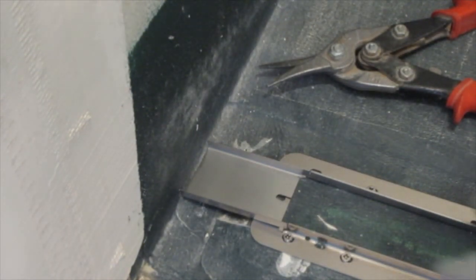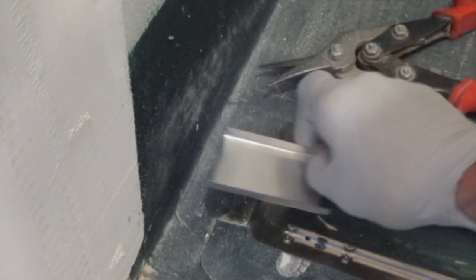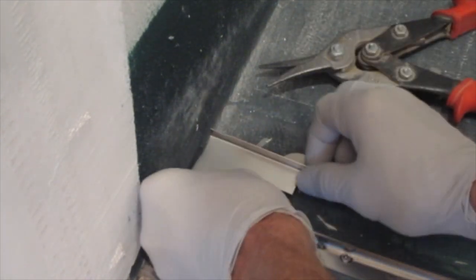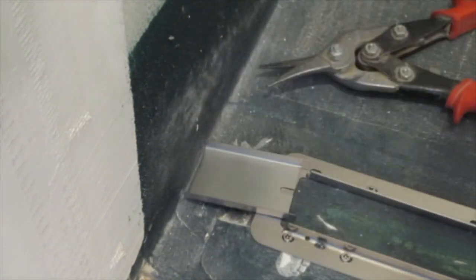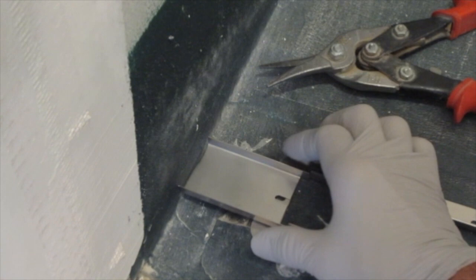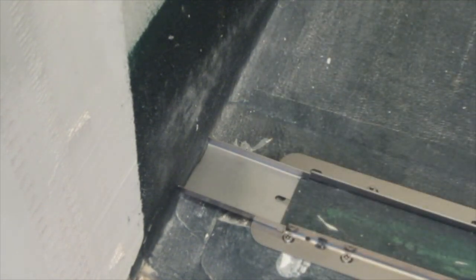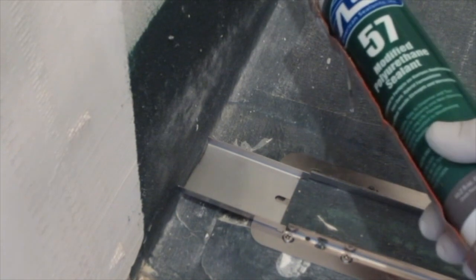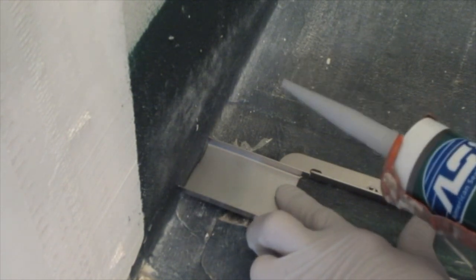I've reinstalled the clamping bar with the screws provided in the small white box. These are your drain extensions. There's a small tab here that's going to line up exactly to the clamping collar so that your other strip — which acts as your Schluter that your tile butts up to — can go along this also. These are trimmable with a pair of snips, not too hard if you've got a good pair. Also, this number 57 modified urethane sealant is what they recommend; they carry this at Quick Drain.